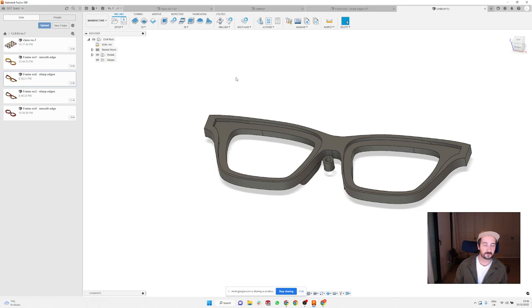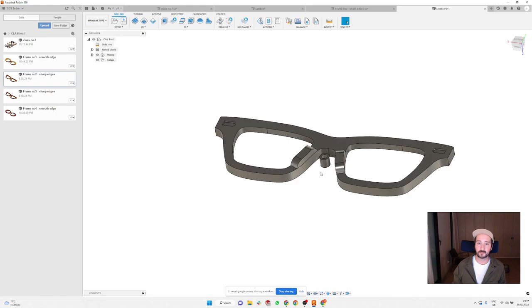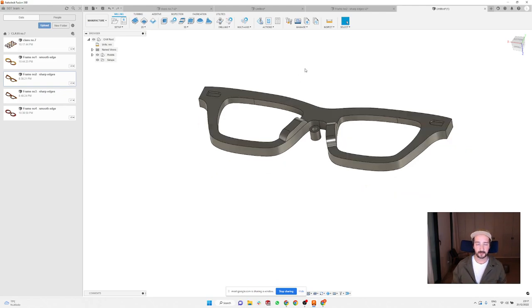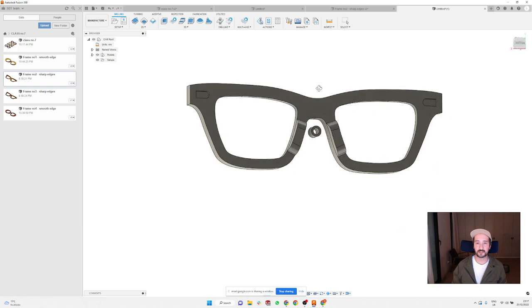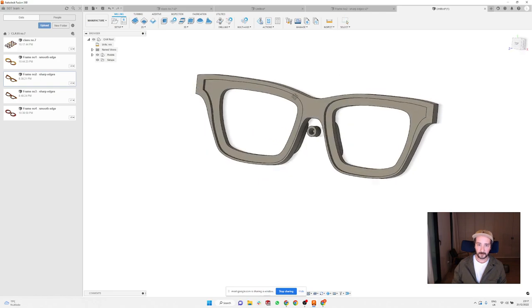It's normally like that because first of all I'm usually having that extra 24 hours to get rid of the acetone from the nose pad gluing, and it works quite well, and it's a bit of a hassle-free version of how to do this. But usually it's an extra 24 hours. And if you do the back first, you need to have your jig on your CNC prepared for the nose pads, so that the whole frame will fit nicely flush with your bed, which most people have, but some people have just a flat bed, so it's a bit tricky. So I'm going to start with the front.